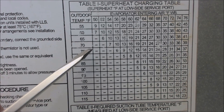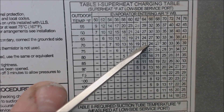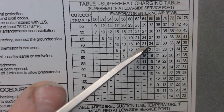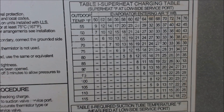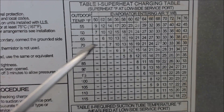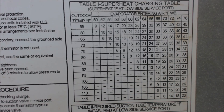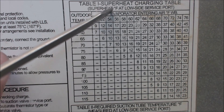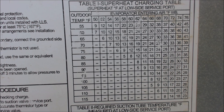Now taking 70 degrees for the outdoor temperature and lining it up with 64-degree wet bulb, we get 21 again. If the numbers were off, you'd take the average. Remember, you have to continually check the superheat as the wet bulb temperature inside the house lowers while the unit is running — say after 10 minutes the wet bulb drops and your required superheat reduces to 19. You have to check every 10 to 15 minutes, because on systems with pistons or capillary tubes, the required superheat changes as you are charging the unit.